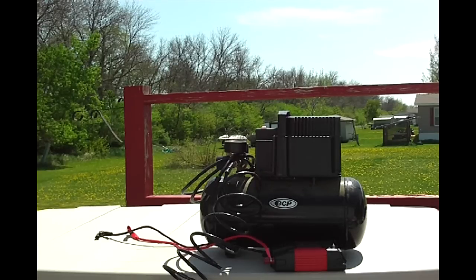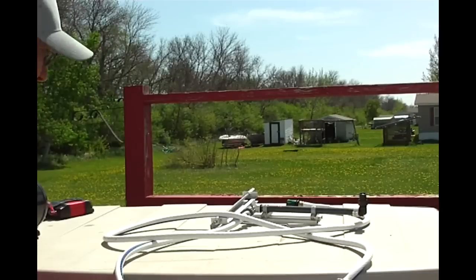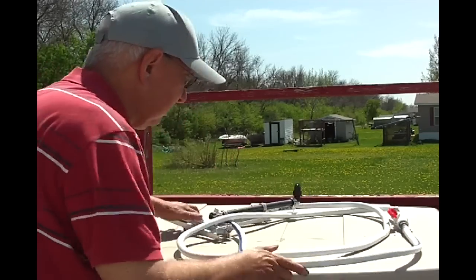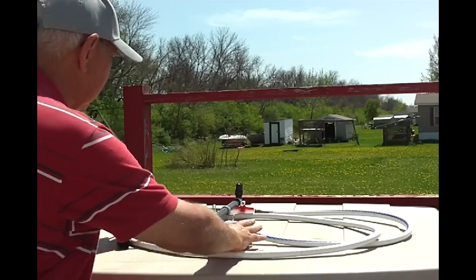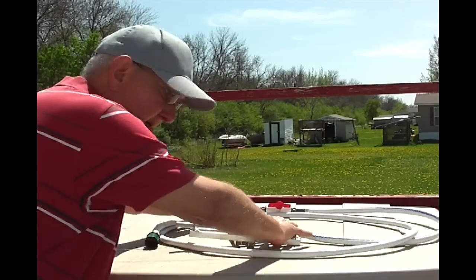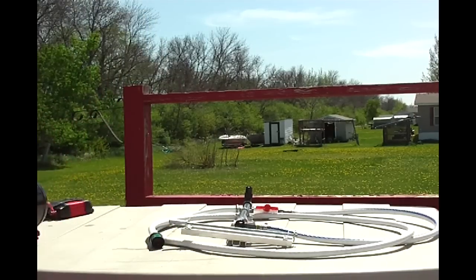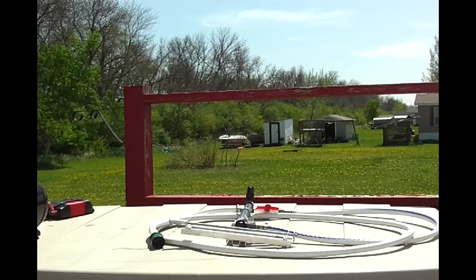The plan is to keep pressure in the drum under 10 PSI. The quarter-inch thick plastic should be okay with that. A shut-off valve, lawn irrigation shrub nozzle — more nozzles could be used — some bits and pieces of lawn irrigation plumbing, around 15 feet of garden hose, and a way to mount the nozzle in front of the lawn tractor, because I don't want to twist and turn to see how it's spraying. Ready for a test run.